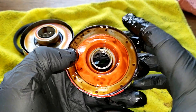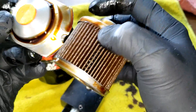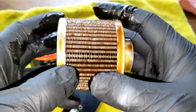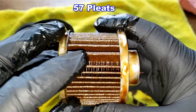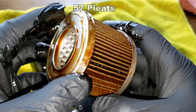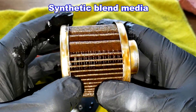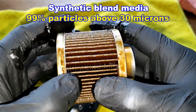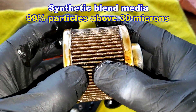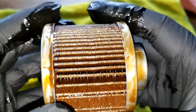It's kind of loose here but it covers the holes. Now the filter element — it's a combo valve here, stamp leaf spring. I'll put the number of pleats on screen. There's a glued seam with a little bit of a gap, metal end caps, and a little bit of glue here. This is a synthetic blend media with a micron rating of 99% efficiency on particles greater than 30 microns. It all looks good — I don't see any tears or anything unusual.